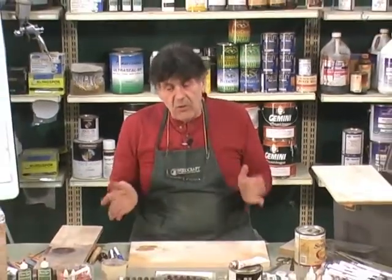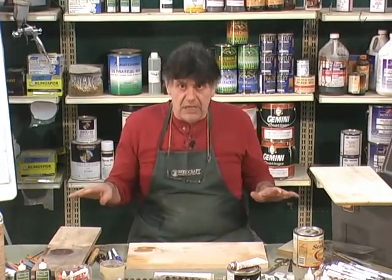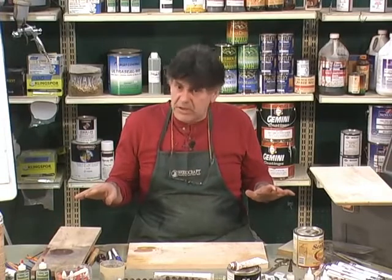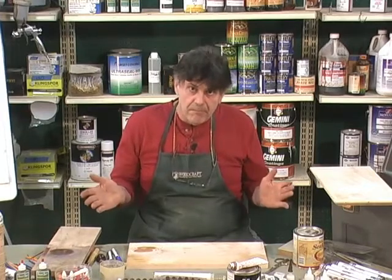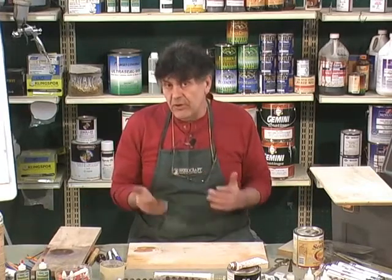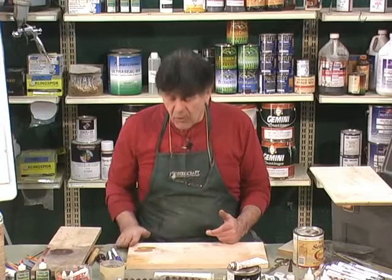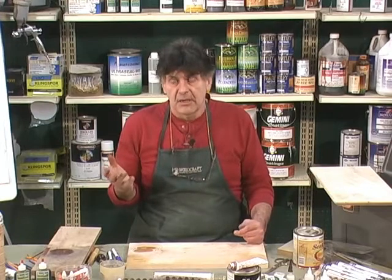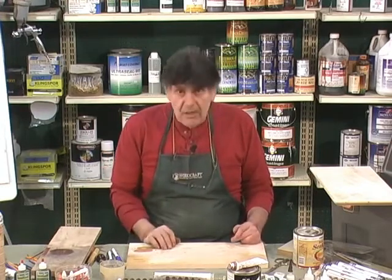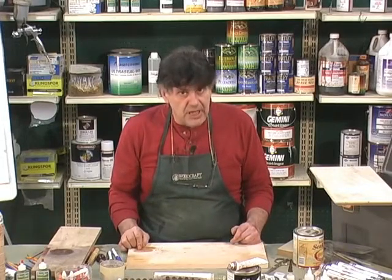So here's the rule. If you're using a water-based stain, a water-based filler is going to take it. It's not going to color an epoxy or a solvent base. They just don't. Now, if you're using a solvent base, an alcohol dye or whatever, then it will color the solvent base, and it will color some on the epoxy because the alcohol base will bite in. The water doesn't.